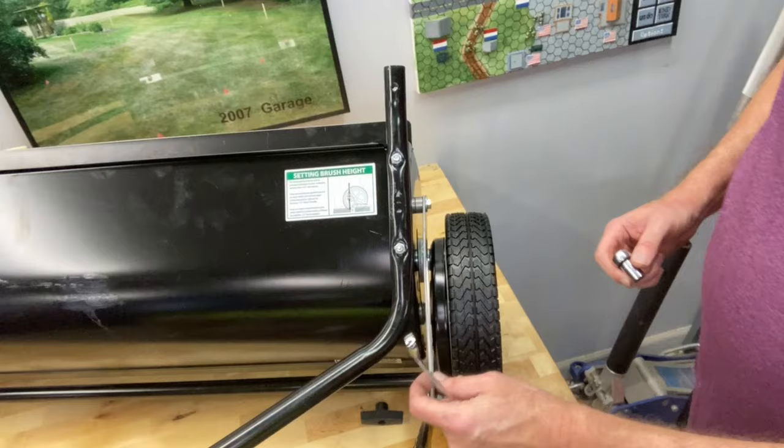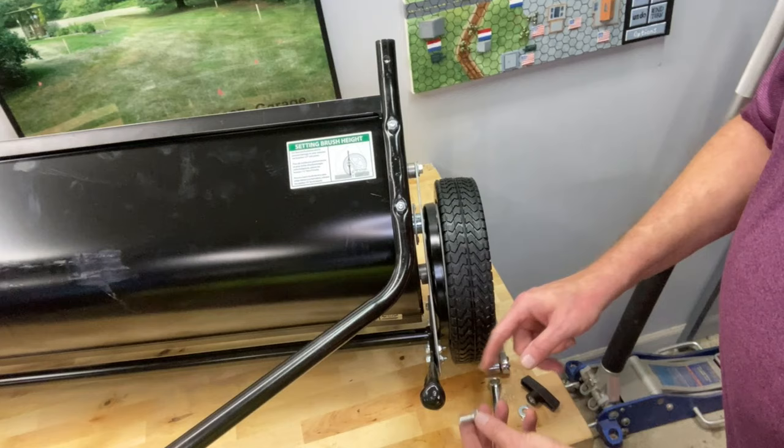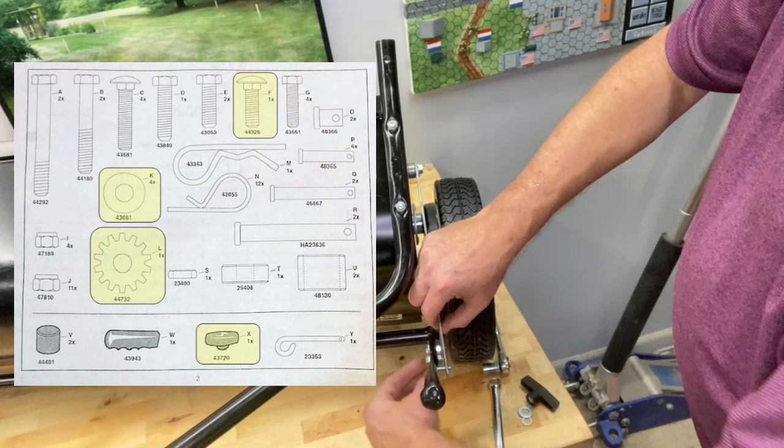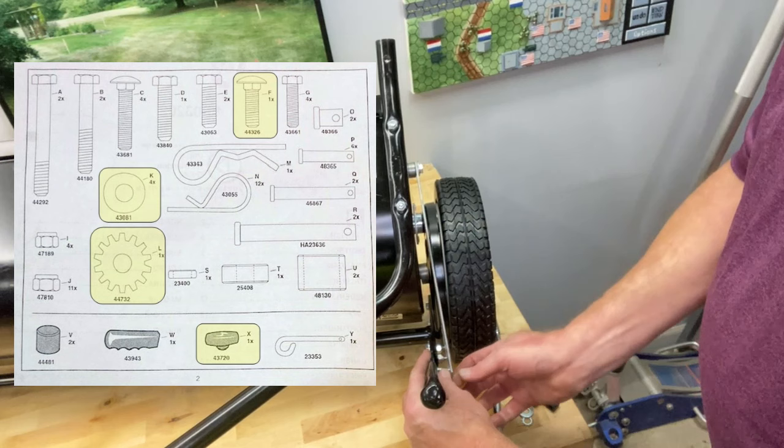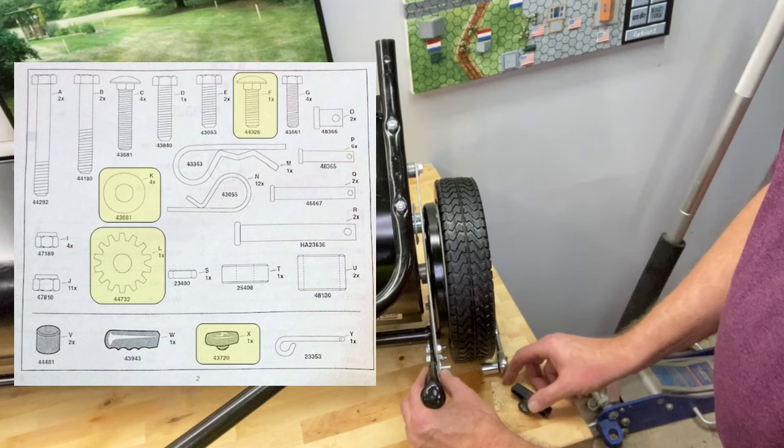Relatively a little shake. So this, as you can see, kind of naturally wants to be on the outboard side of the lever. And there's one hole here. That hole's got a square, it's a square hole. So this bolt's going to go in there. So no washer, make sure the squares fit in the square hole. Oops, I'm sorry. We actually need this lock washer on there. Then that. Then the last remaining flat washer. And our little T-nut.